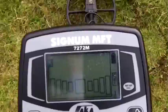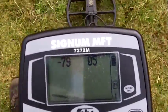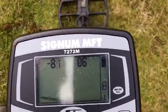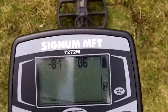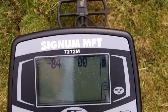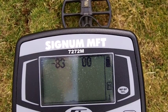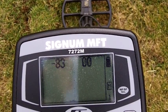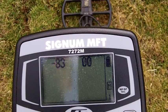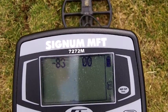Nothing... there — iron. I have it set really low to make it manageable. So the hole was full of iron. This machine is really sensitive with iron — it'll pick out a good target within iron, but you can't really depend on the hodograph or the bottle cap check with iron. It's getting such mixed signals, so I'd suggest you are really careful with relying too much on anything. Anyway, hope that was helpful.